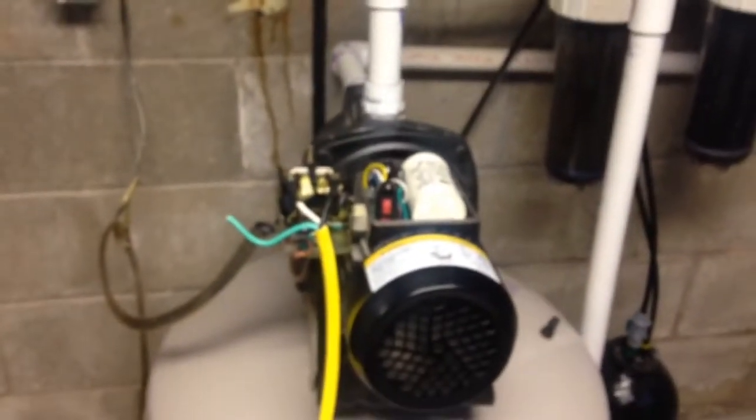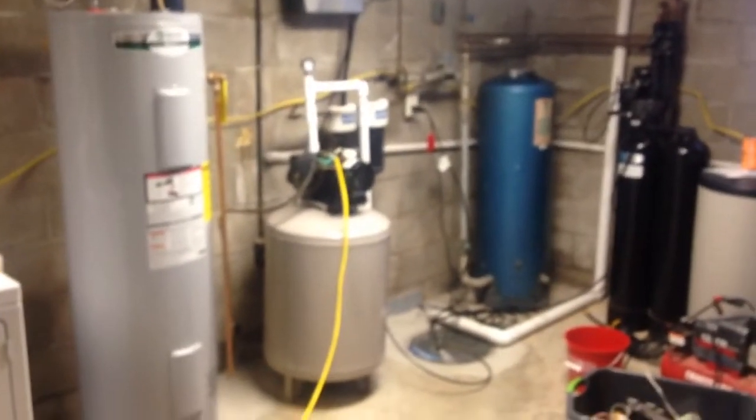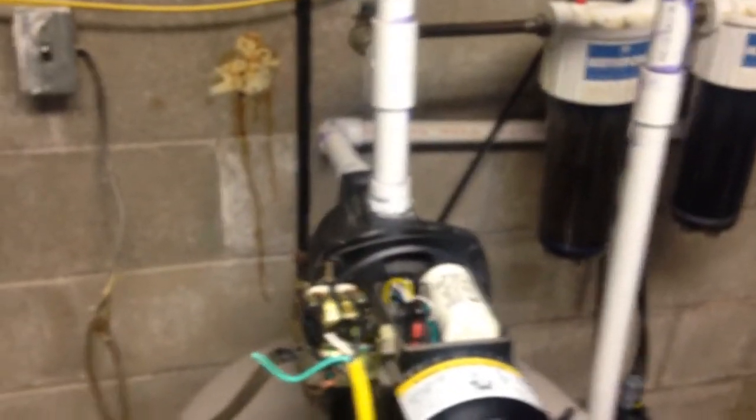There we go — it came on! It didn't particularly like it, but it worked. That's right, 100% off solar. The inverter is reading around 11.5, 11.4, and fluctuating. And off it goes. It didn't particularly like the startup, but obviously it did work. I'm surprised it actually kicked on — this inverter will surge at 6000 watts for starting loads like that for a brief moment.